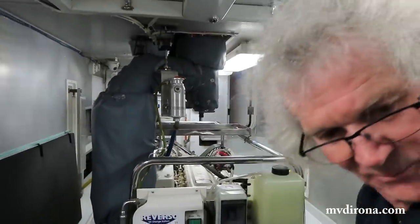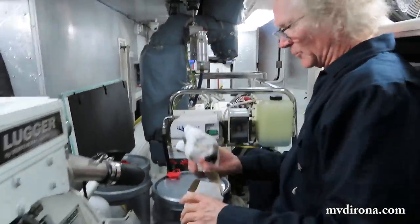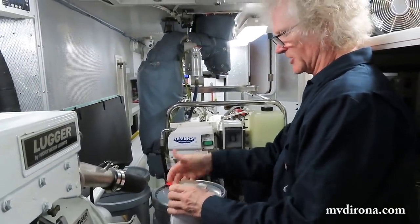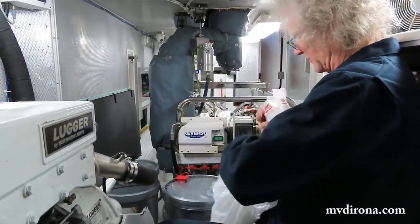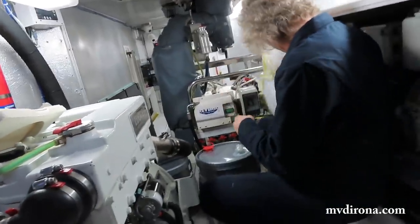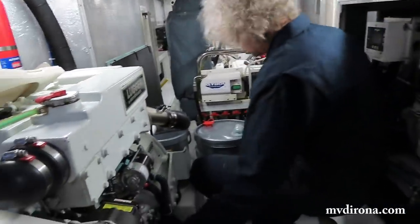Did you see where I put... pass me that oil container, the old box. There you go. I like to put an oil rag on there, oil diaper on there, and stick the filter back into the old box. Just make sure that no residue runs anywhere. Then what we'll do is we'll drop it into a bag. I'll bag up this and anything else that we use as part of the job. And eventually, when I'm done, I'll double bag it just to be on the safe side.